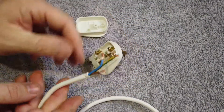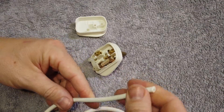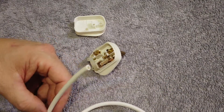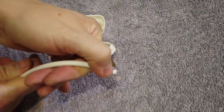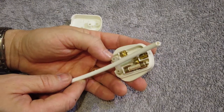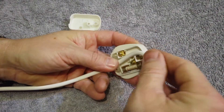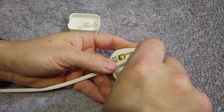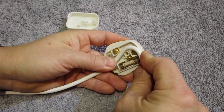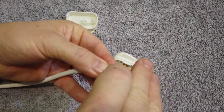So now we've got our new wire — I've just fitted some security cameras and I need to power them up. This is a three-core 0.75mm wire. When you're faced with the plug, first thing to do is just mock it up to where you want it, because you want the wire to come in and go round in a nice neat pattern. The earth wire is always the longest one. We want to go slightly longer to start with — then we're going to peel the sheath back from where we want it, bending it over double right where we want to peel it off.